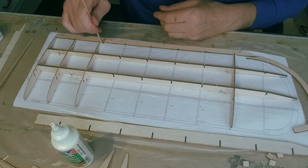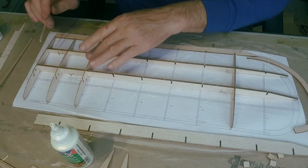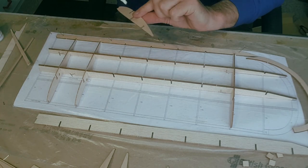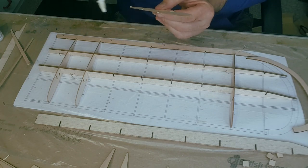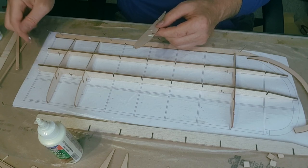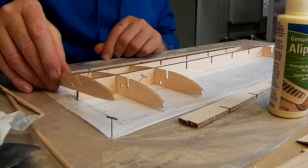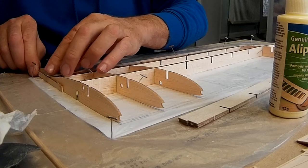It's still moving around a little because glue has pushed it as it went in - I can always run a little bit in afterwards. For the end one, it's end grain so I'll coat that well. I accidentally glued a slot that didn't need glue - just wipe that off. It needs a pin to keep it nice and tight.